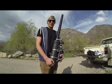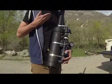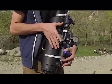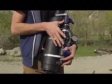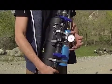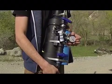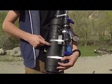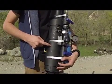Right here we have our modified potato cannon with a direct propane injection system. Here we have a chamber for measuring with two valves. Once we let propane out of this tank, we measure how much PSI is in here, and using the ideal gas law we can measure the amount of propane to the amount of air in the chamber that we'll be mixing.